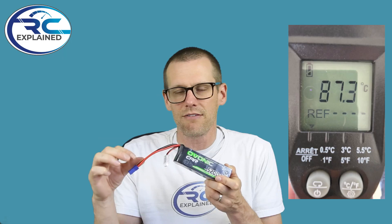We know that the EC5 is very limiting when it comes to around 95 to 105 amps continuous load. We're going to build all kinds of heat in this connector and that heat is going to travel down the wires and start to heat up the ends of the battery. I definitely see this when I do enough of these tests and measure the temperature in this general area on the front end of that pack.